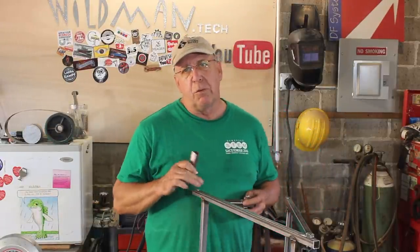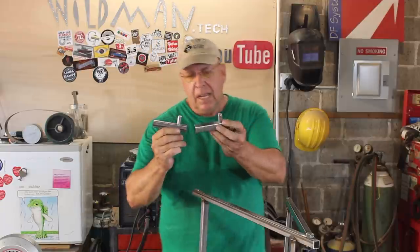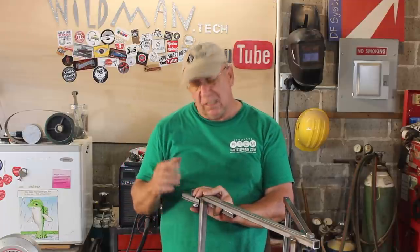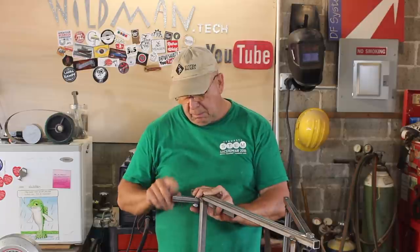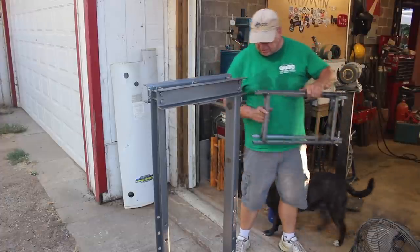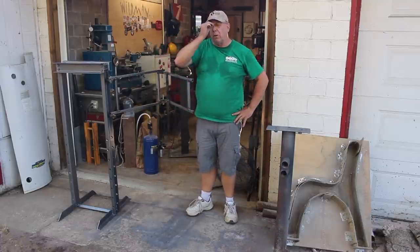Since I'm going to have this removable, I've taken a couple of half-inch bolts and cut the threads off them — this will just slide on. By putting these in place, this is how I'm going to locate the mounting place for these over on the hydraulic press. So we'll do a test fit. I've got my hinge hangers in place — this is looking pretty good, exactly what I was going for.